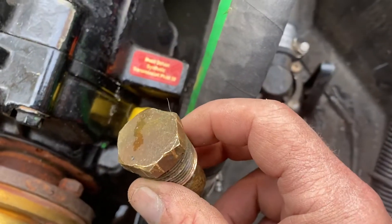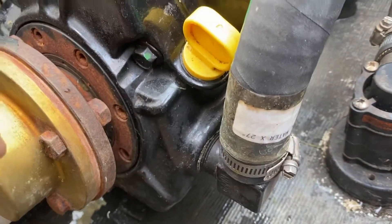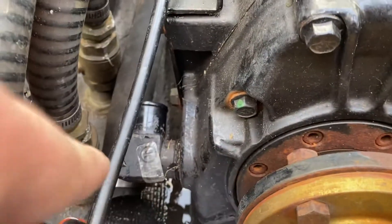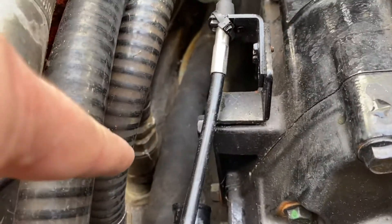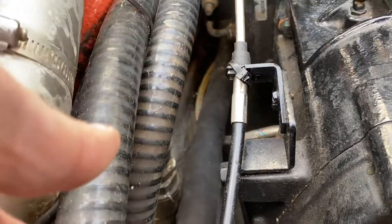At the bottom of the V-Drive, there's a bolt at the bottom that you remove. I did remove the cooling hose that comes off of this elbow and feeds back to the impeller, so all of the water that remains in that hose up to the impeller drains down.